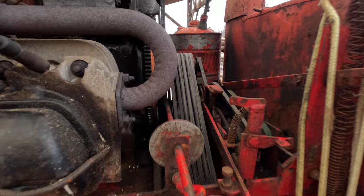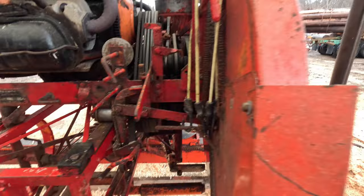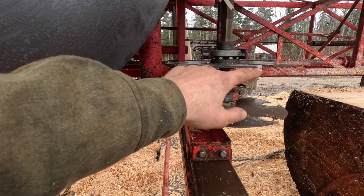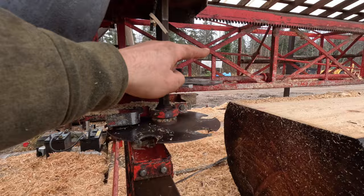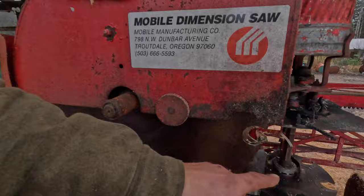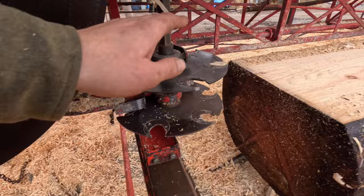Why not? So you set your top edger blade to 4 inches. Do you see that? That sets the distance between the two blades at exactly 4 inches. So we need to drop our mill 4.5 inches for that. We're gonna make another 2x4 above this, and the top of that 2x4 is gonna be this cut we've already made. So we're gonna drop 4.5 and another 4.5 to 9 inches. The bottom 2x4 is gonna be perfect no matter what, because this is fixed. The top one, you make your first cut, measure the width, and you might need to move your mill up or down about a 16th of an inch or an 1/8 of an inch to make that work out nicely.